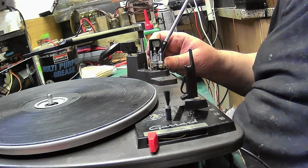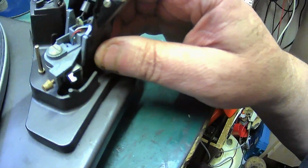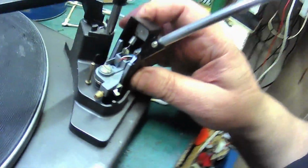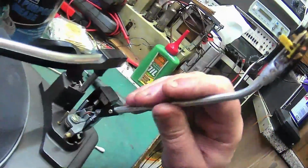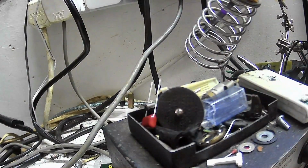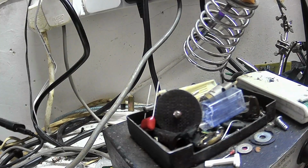So you don't, let's bring you in a bit closer. See, there's your stylus, there's your stylus set down point screw. They are made so you can turn them by hand. And if we look under the arm, you can see you just got your spring there with one hole. That's not adjustable on this model. What you get is what you're given. But it should be about 5 grams, 4 or 5 grams. And that screw in the top there is for the height. So don't adjust that thinking it's stylus pressure, because it ain't. I would imagine they use a specially calibrated spring.